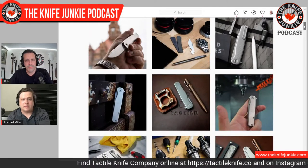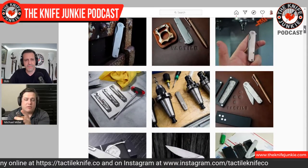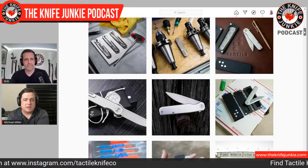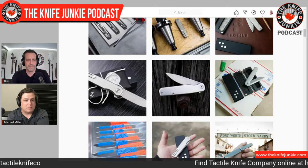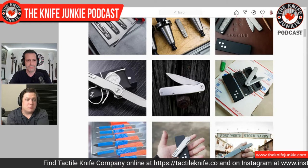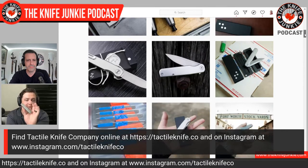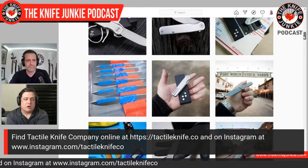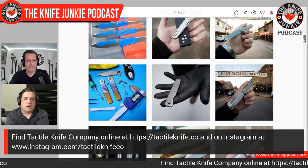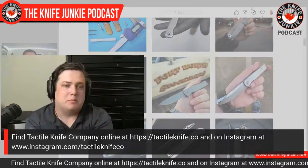The reason we don't make the stop pin is because it's extremely efficient to buy one at the tolerance we need. The ceramic bearings are just something that nobody makes in house. We're milling everything. We're running our screws on a Swiss lathe, running our pivots on a Swiss lathe. We're doing every single part in house that we possibly can. There's a small, tiny little screw holding in the lock bar — you can barely see it — but that's made by us.